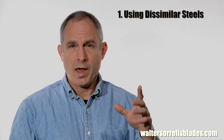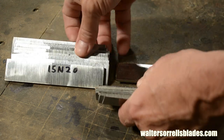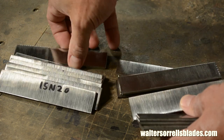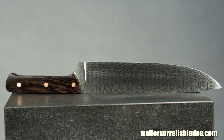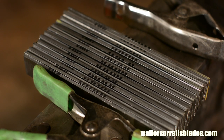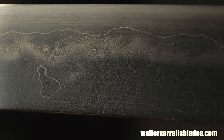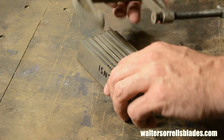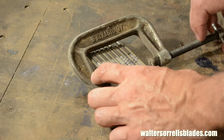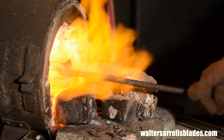First: steel. At a basic level, what makes Damascus work? Dissimilar steels. You can make Damascus patterns by using fairly similar steels like 1050 and 1095, or by using a steel that oxidizes easily with one that doesn't. It all depends on how vivid you want the patterns to be. When you use closer steels like 1050 and 1095, you're going to have a subtler pattern — for instance, for Japanese swords I don't want a ridiculously bold pattern, so I'll use two carbon steels. But typically western smiths use nickel-based steel like 15N20 with a high carbon steel like 1095. This gives lots of contrast when the steel is etched, giving a bold, clear pattern. And that's what we'll be showing today.